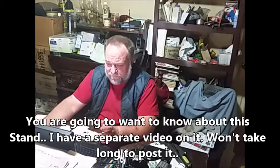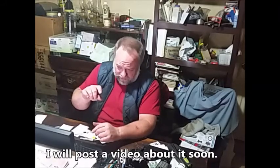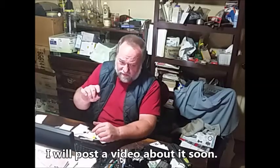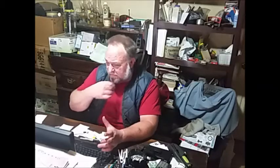All right, the stands. I have a stand that I made out of 6-inch square tubing, 6-inch by 3/16, 4 pieces standing up. Half inch plate on the bottom, half inch plate on the top. A 2-inch wide by 1/8-inch thick piece of flat bar that I heated and bent around the anvil and welded to the half inch plate so I could pull the top off in case I wanted to fill it up with sand or sawdust or anything like that. But there's nothing in there, okay? And then a simple stump. It's a softwood stump. I don't remember exactly what kind of stump it was. Doesn't matter that much when you stand them up on end. They're way more than what you're going to, you know, hit with your hand as far as the strength goes.